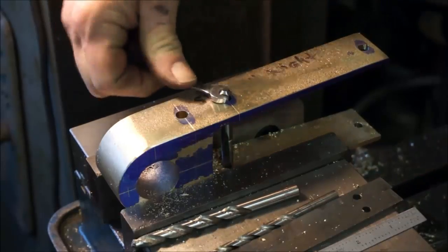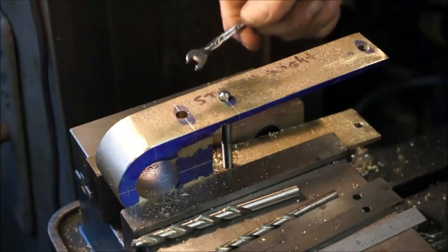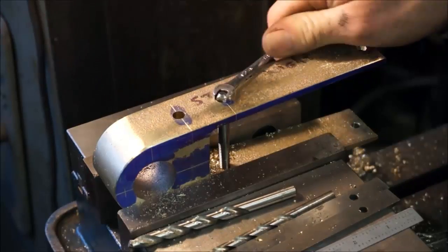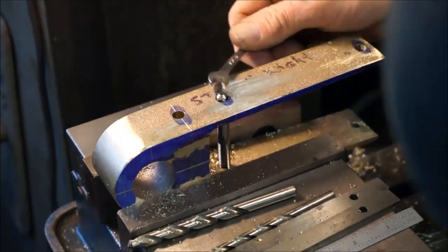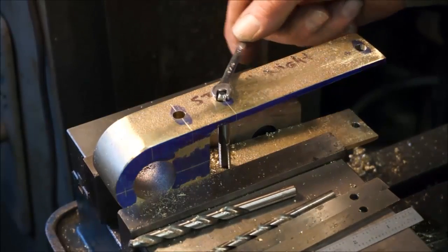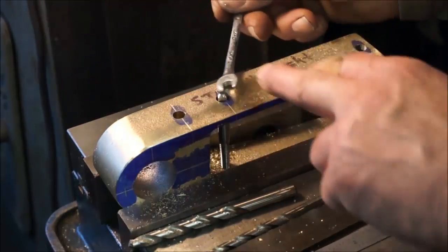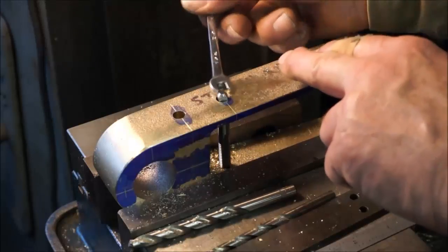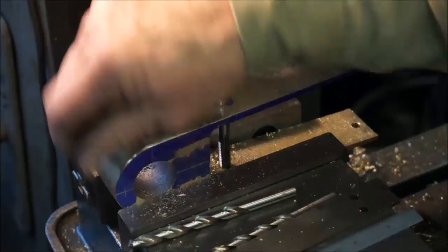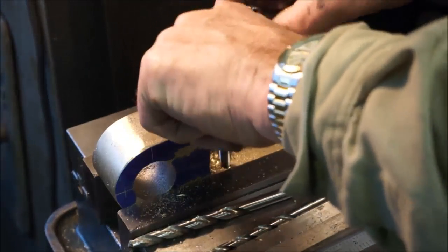And the hole still guides the tap. So the main thing is if I can get this down and then I can grab it underneath here without locking the tap up. Maybe not. I don't want to lose the tap. After we split it, we'll just put the tap back in from this side here and continue on through, just like the first hole.